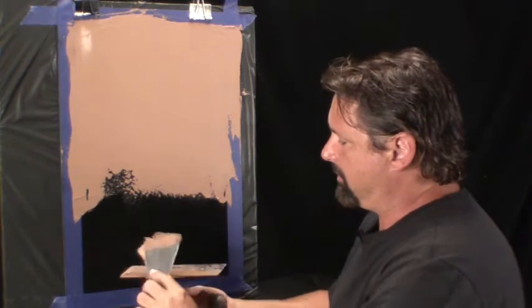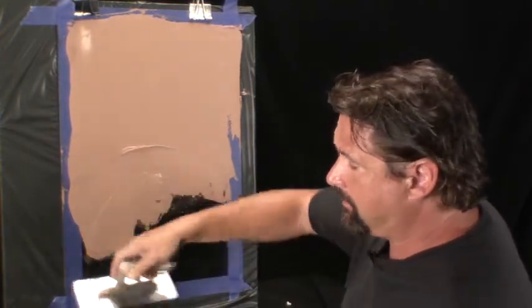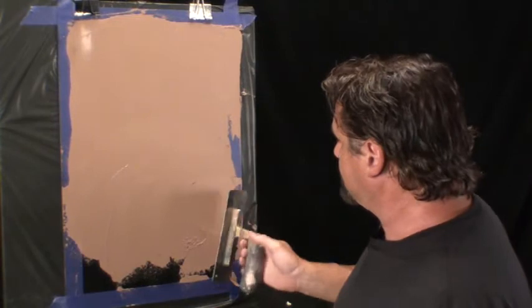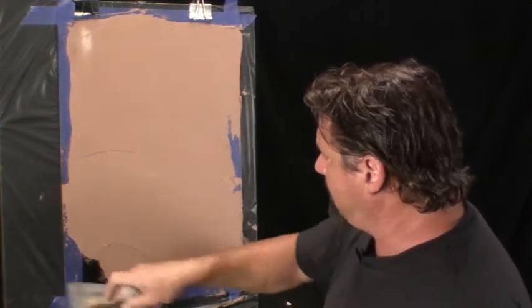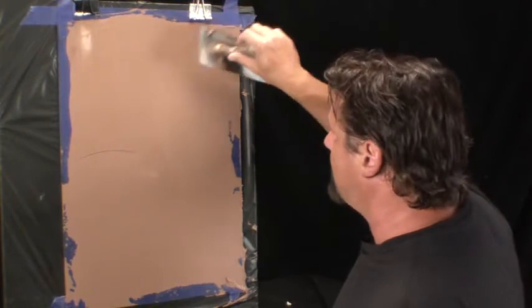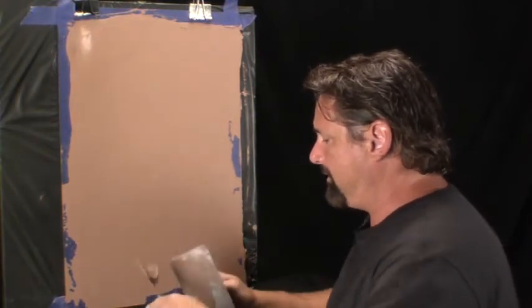Take the spatula, gather it up. You always want to work the blades almost flat and at a somewhat higher angle — so almost flat, then higher angle, then flat. We're not trying to go for a real smooth finish, but we're also not going for a lot of busy texture. This is the base for the next coat of plaster. The color of this is called Cinnamon Slate. I'll do a couple of finishing passes just to make it clean. That's it for that application.